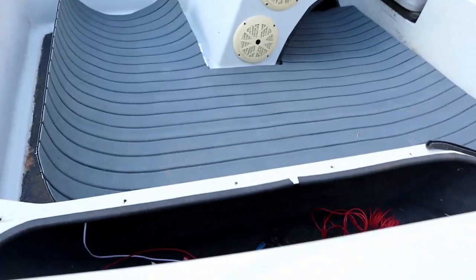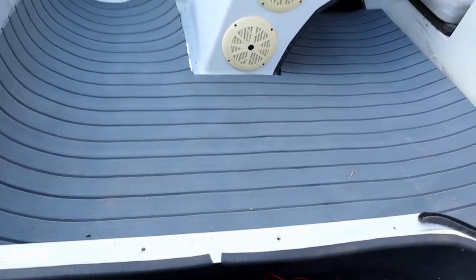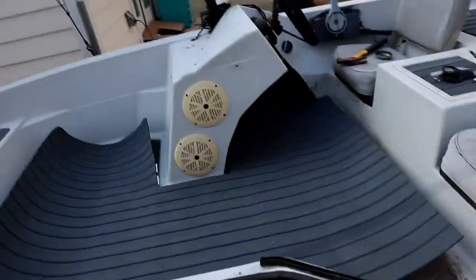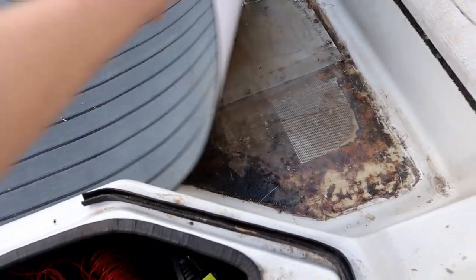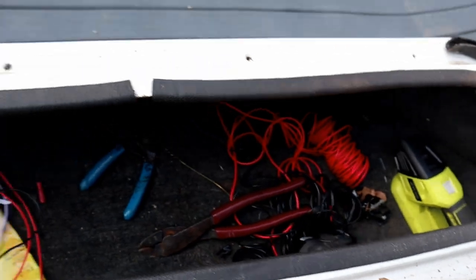But right now we are putting the final sea deck in, and let me show you the parts that you guys missed, because I couldn't show you because of the video corruption. But here is the sea deck I just cut out that we're putting in the floor. We got that one up there done and the ones back here, and we've redone the floor. We put sheet metal down and then fiberglass coated it over so it's super strong again. And I sanded down all the hatches real good, and I've started on the wiring.